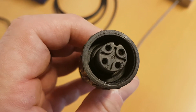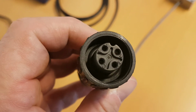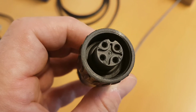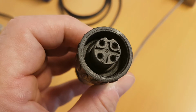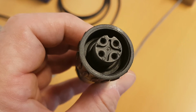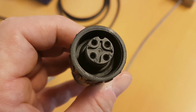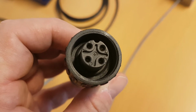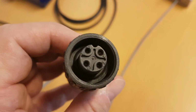If we examine the signal connector, we can see that we have the numbered pins there, and from the schematic we saw in the first video, we know that the current loop is on pin 1 and 2. So if we make a short circuit between 1 and 2, we are going to make a very local current loop just with the SDU and its signal cable.